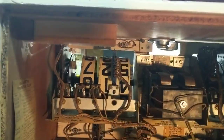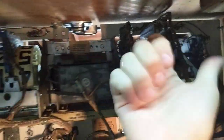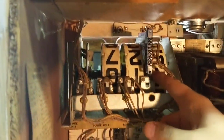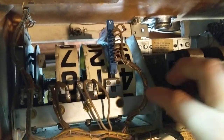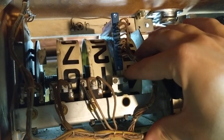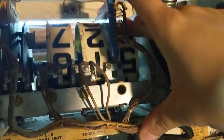So how these all work is on a clutch system. When these motors are on and spinning, you can see there's little linkages that connect the motor with the drive shafts that control these different sides. You also have these little relay catches here, and you can see it's catching on the edge of that reel. These are kind of always spinning during game operation, and when it wants to advance the score, it lifts back this relay for just a second, the reel will catch, rotate to the next position, and that plastic on there stops it from advancing again — that's the limit of the clutch.